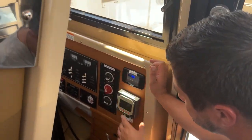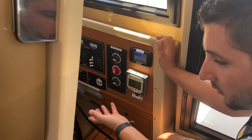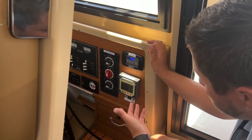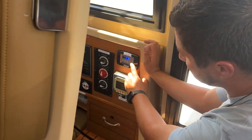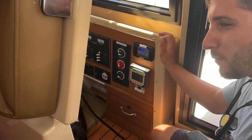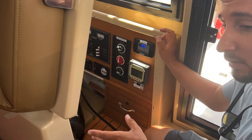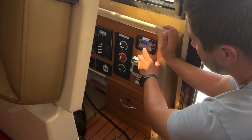As we're sitting here, you won't see anything, but if you touch a button, you'll be able to see what the current temperature inside the boat is. What we have it set to is 61, but then it'll read back to you the current temperature, which is 78. And there's a mode button here. If we click this, we can switch between snowflake, to the sun, which is heat, or the glass, which is dehumidifier mode. Dehumidifier mode isn't really dehumidifier mode. There's a fan speed button, but fan speed does almost nothing. These Webasto unit fan speeds just don't really work.